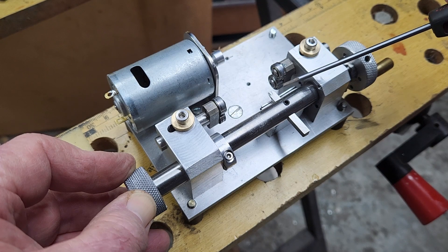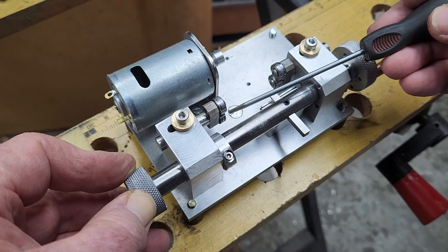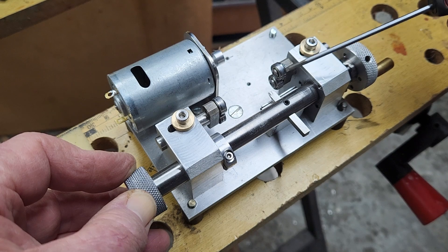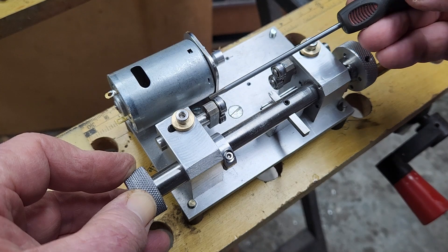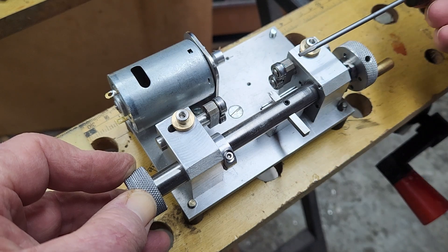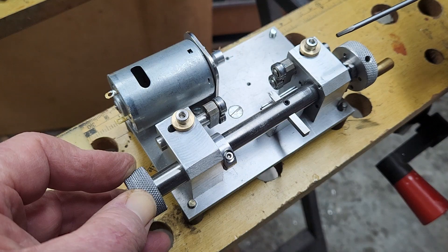These cradles have short stops in them. You generally don't need it at the gear end, but you do need it because people cut the axle off very close, so I've got stops here. In this case it's on the other side, so you can turn it over, release these clamps, and move the guides in and out to adapt to almost any length of slot car motor.